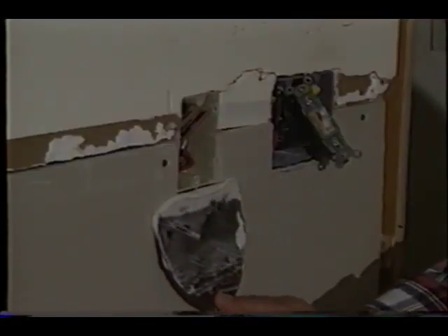Here's how you go ahead and repair it. Make sure that you blow any dust and loose drywall out of the way first. A lot of people make a mistake and just make a simple swipe of the material, then smooth it over with a cross stroke and think that's okay.